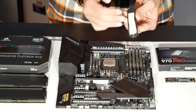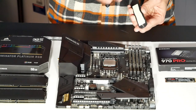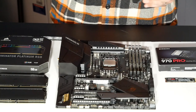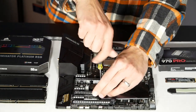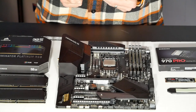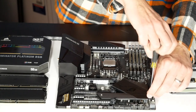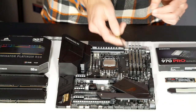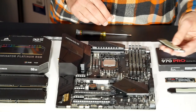This is the heatsink cover. There's thermal tape on one side — that's not to be removed. If you just took this out of the box, it would have a plastic shipping cover over the tape, but the tape itself is part of the thermal solution and stays. I'll put this down so the tape doesn't pick up dust. The screws are often applied with a blue Loctite formula to lock them in, so you do need quite a bit of force — but don't try a bigger screwdriver, you will strip the screws.